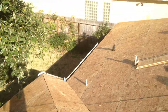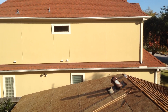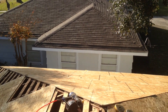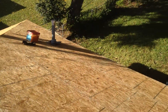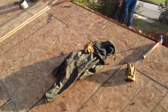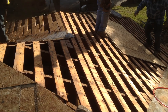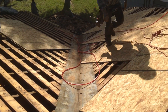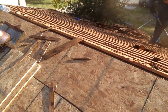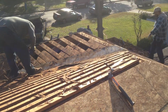Like I said, this is a very old home. You can see the next door house — it's a pretty nice stucco. And this one's an old home with a bad layover. This was a two-layer comp over wood shingles, so the house was probably built in the 60s. It's about 28 squares — we weren't aware of the second layer of composition roof.